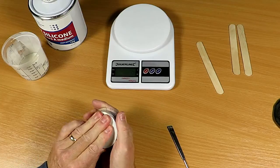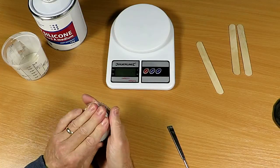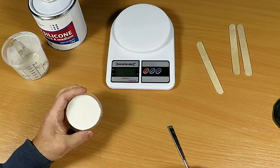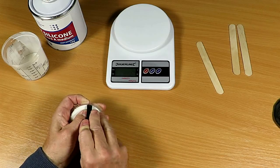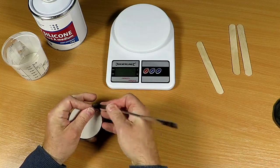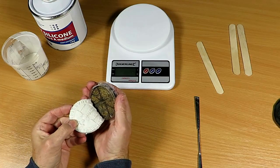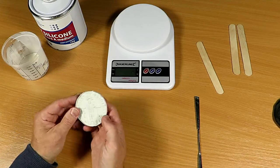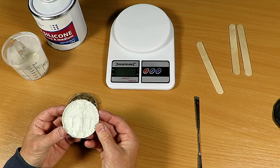What I'm going to do is just try and release the little edges like this from the mould, pulling it away from the plastic. There we go — that should be good. If I just see if I can get behind it with this... there we go, that's coming now. We'll just peel it out carefully. So there's the original seal, and there's my new moulded silicone rubber coin.